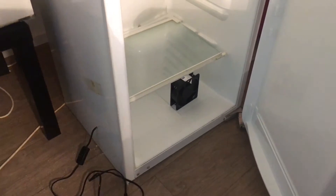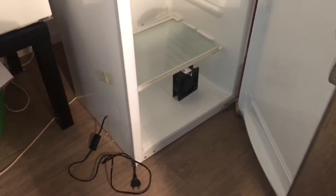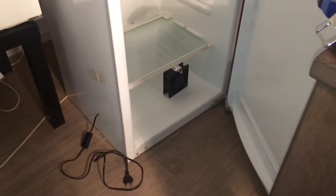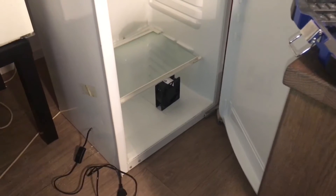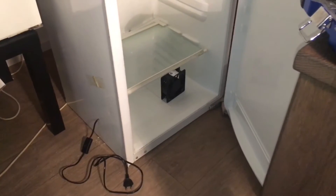First challenge is to drill through the side without puncturing a cooling pipe. The hole is drilled — six millimeter wall going right through to the inside. I'm going to install the heater at the bottom, quite sensibly, because heat rises. The fan is going to sit in the bottom there. I'm not going to earth it because once it's installed I'll never touch it — that's where the risk comes. The rest is plastic so it's insulated.